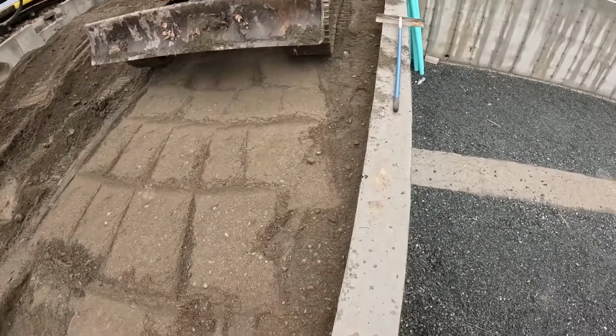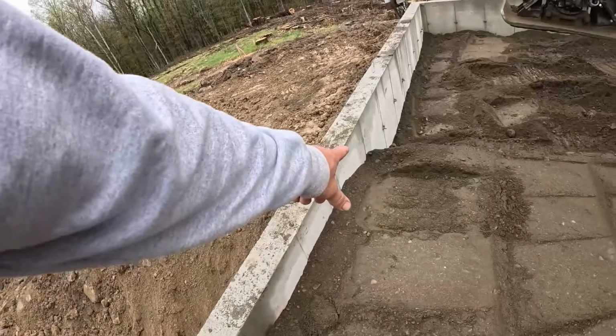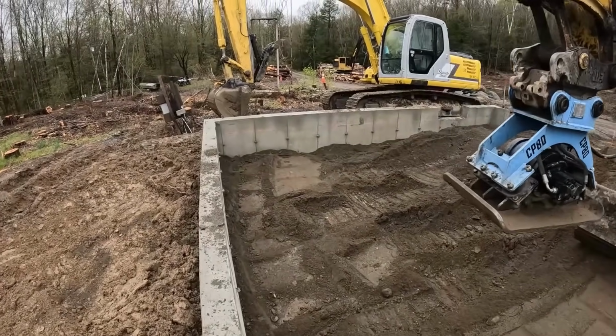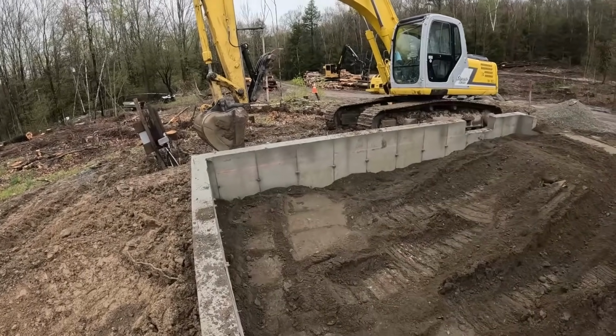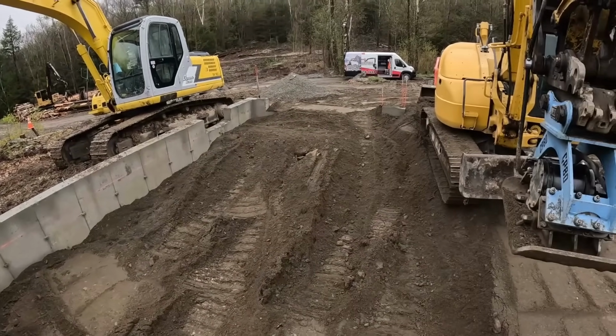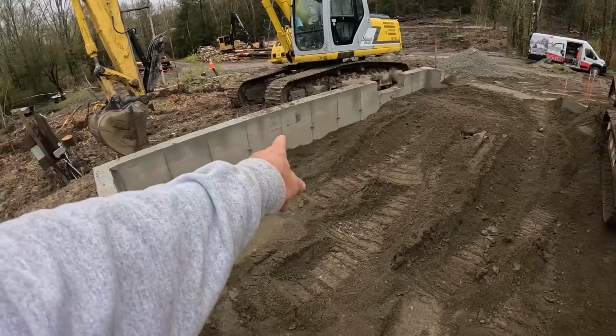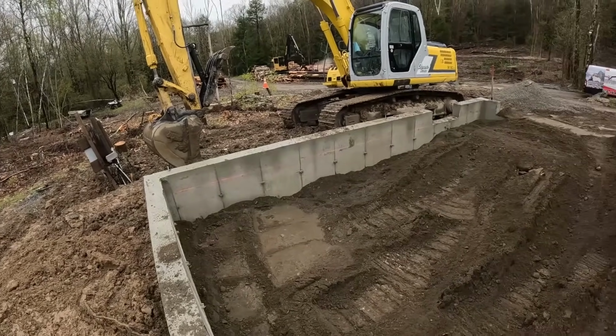Got to come along there to get us up to that line. We snapped orange lines through there. 2-inch pitch on the sub base, which will give you a 2-inch pitch on the concrete floor. All you do is measure your drop. So that's a 12-inch drop up there. Measure down 10 inches, automatically 2 inches.